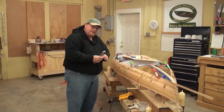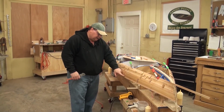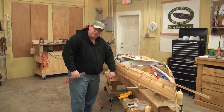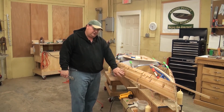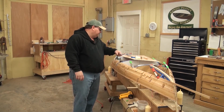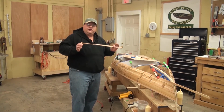All right, so that's the safest way to take it off. Just add a little heat to it, and then later on I'll come back with a nice sharp chisel, and this will come right off. The chisel is so that we're not wasting tons and tons of sandpaper, because this will goo up your sandpaper butt quick.